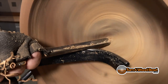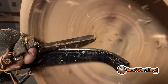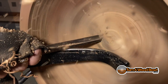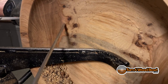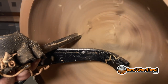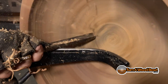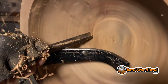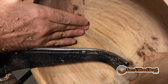One of the biggest things with getting the wall thickness correct — it takes a little bit of time, and we all have to go through the bottom of a couple bowls at least a few times to understand what's happening — is you really want to just sneak up on that thickness. I'm checking the thickness here. I can see in the bottom it's still thick — it's flat across the bottom and almost convex. I want the bottom of all my bowls to be concave and to match the curve of the bowl — a nice fluid curve that goes right through the base. We need to sneak up on that final pass and not make bold, aggressive, deep cuts at this point. Just making very light cuts to get to the final thickness.